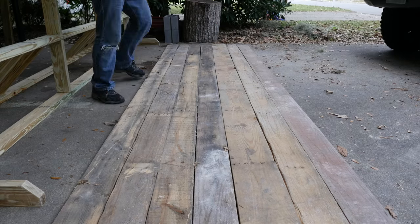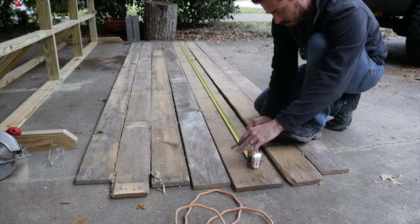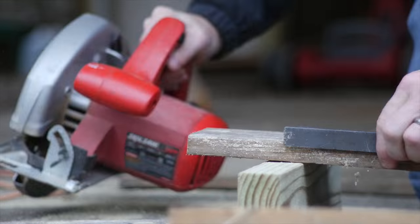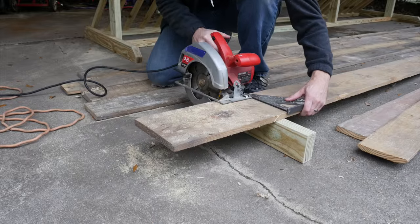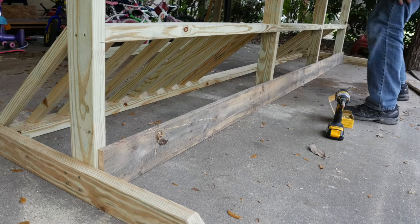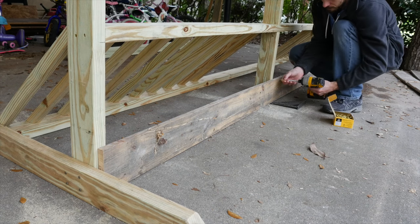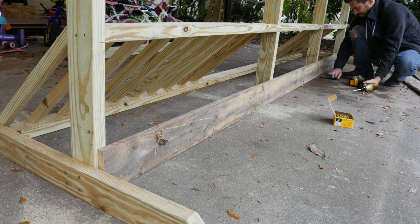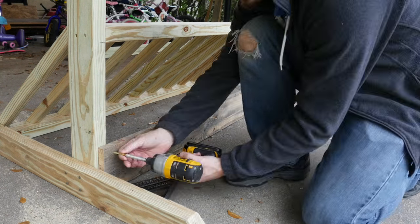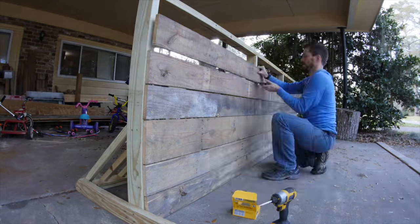To cover the front, I used slats from a gigantic pallet that a friend of mine had given me, and I cut them all down to the same length, which was 12 feet, to match the boards that I'd used in the frame. The speed square is really handy on this project because it makes it easy to cut straight lines with a circular saw on just about any surface. You can also use it as a spacer to lift things off the ground just a little bit. I put it underneath the bottom board and put in one screw on each one of the joints, then added the second screw to each joint and did the same thing all the way up.